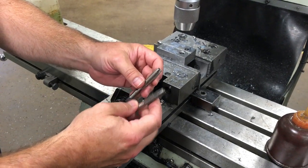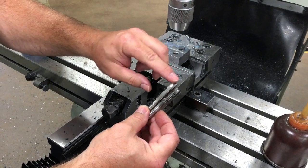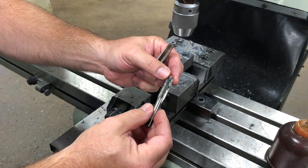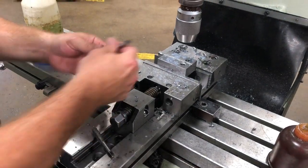So what we have here is the difference. This is a gun tap — it's going to push the chips forward. This is a hand tap — it won't machine very well. You can use it in a pinch but there's a good chance of breaking it, and with this demo I don't want to break it. So I'll put the gun tap in.